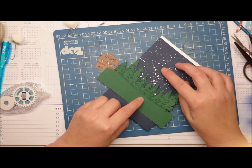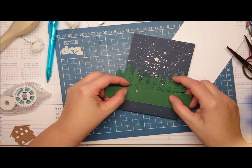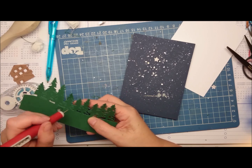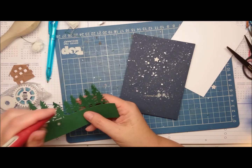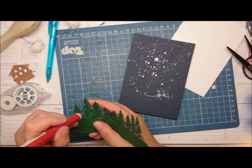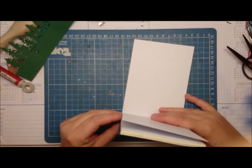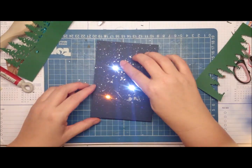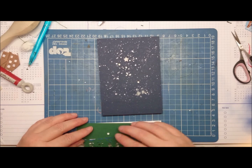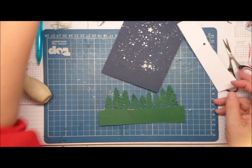So if the batteries are empty, you can't get to them anymore, and this one has to go into the bin practically after four hours of work. It's trash. That makes me really sad. But yeah, the SMD lights, the small rectangle ones, people try to glue them with super glue or contact glue, but you are at risk of covering your really small contact points, as I said. And soldering is the best, but then people have burned holes through the cards, so be careful with that as well. And that's why I only show you how to use these lights, because I think those are more friendly to use.